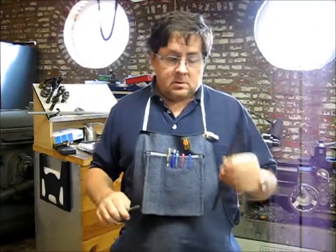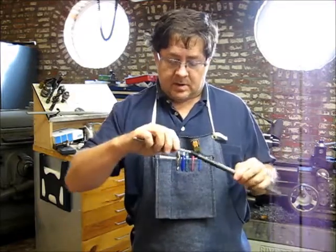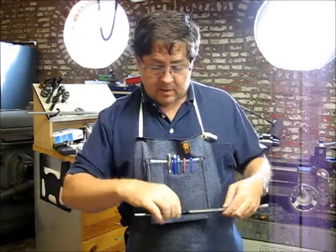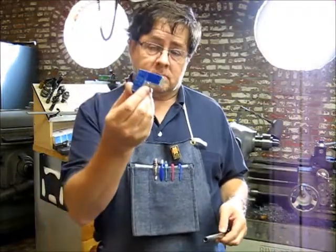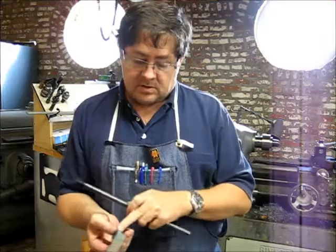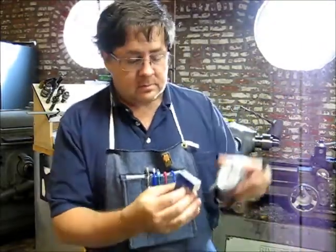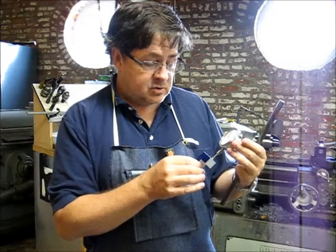Alright guys, so we got our tube threaded with our hardened bushing in the end. We got our dowel pin, which is a very snug fit into the bushing. We're obviously going to have to cut this off. It's a lot longer than it needs to be. What we're going to make now is the mount for the indicator. This is going to be cleaned up, drilled and tapped for a half by 20, so it'll thread on here, like so. Then the indicator will drop in here, as I'm sure you saw in the pictures in the post that I linked to in the description.